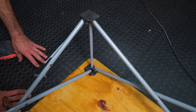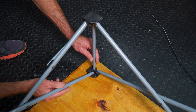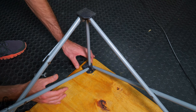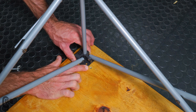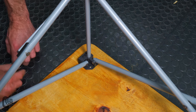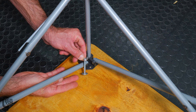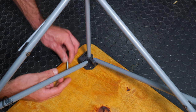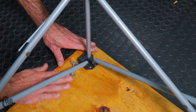The last thing is how we join the wooden top to the frame. Without joining them, the frame and wooden top would slide around and potentially slide off the corner — the bed could fall apart. At each of the four corners, I drilled a 6mm hole through the plywood and a matching hole through the leftover plastic on the frame. We line those up and use the same 6mm bolt — 50mm long — sliding it in from the bottom and tightening a washer and wing nut. Once set on the ground, it's rock solid.